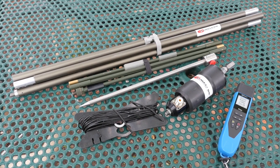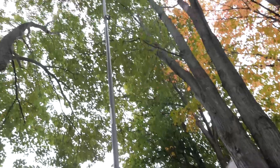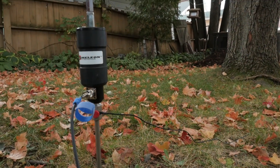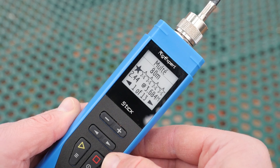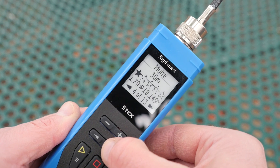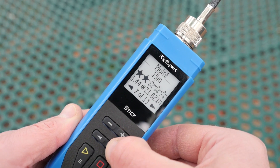For a demonstration, I set up the Chameleon M-PAS II vertical antenna in my backyard. This is a non-resonant, multi-band antenna that uses a 5-to-1 transformer and gives an acceptable match on the amateur bands and other frequencies. In most cases the SWR will be 3 to 1 or less, and you can then finish the match with an antenna tuner. Plugging the Stick into the M-PAS II and pressing the multi-button gives me 13 different matches under 3 to 1 in the entire spectrum of HF and VHF bands, rating each one with its star system. I can see that the best match is on the 20-meter band, and with a tuner I can use this antenna on any number of other bands.